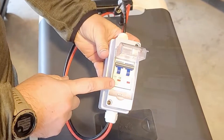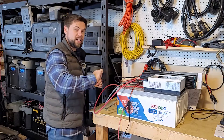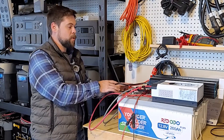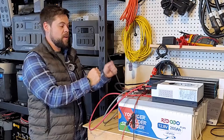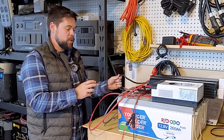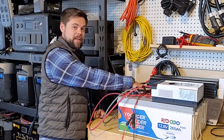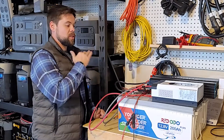Some things I would change: I'd add a DC breaker on the solar input so I can connect wires with the breaker off and flip it when ready — no live energy going to the charge controller until then. Same for the inverter: a DC breaker rated to the inverter's high amperage so I can connect dead wires and flip the switch without worrying about sparks or needing a resistor to pre-charge the capacitors. You could add DC switches on all connections to eliminate sparks entirely.